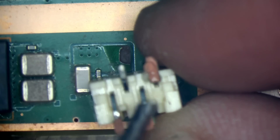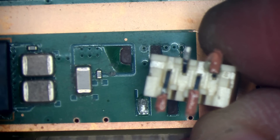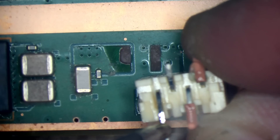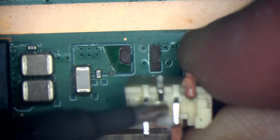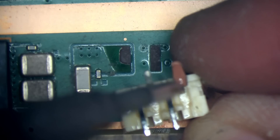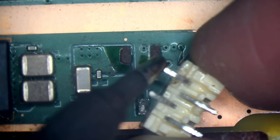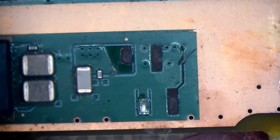I'll add a bit of flux to these pins because we've got to get the old traces off. It would still conduct with those traces still on, but it's best to clean it off. I'll just run the iron over it and it'll desolder the old traces — straightforward enough. People think when they damage these boards they're either a goner or too expensive to fix, but really not. There we go — that's prepped and ready.